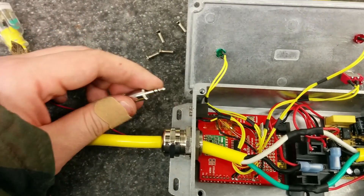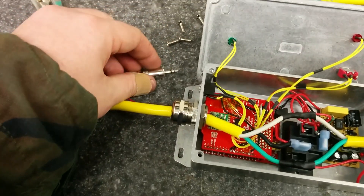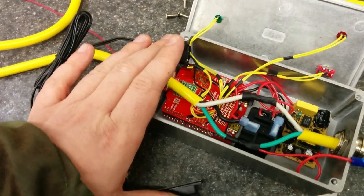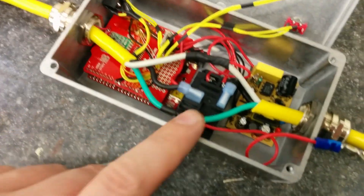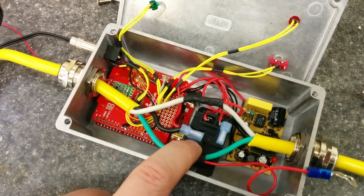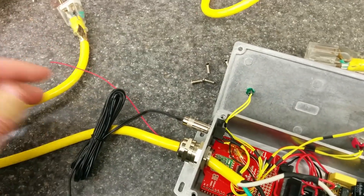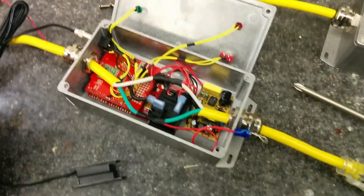This sensor connector has an extra feature: besides making contact with ground when the reed relay closes, there's an additional connector to tell me when the sensor is actually connected. So if you disconnect the sensor accidentally, it will also power off. I'm using a big chunky relay — I think it's a 30-amp relay, which is more than overkill. The antenna wire from the radio runs out to the side through these cable glands. That is the major construction — fairly simple.